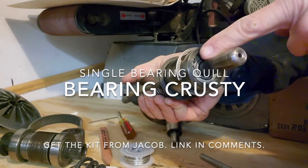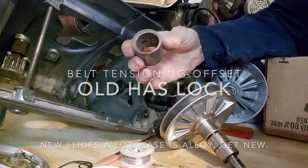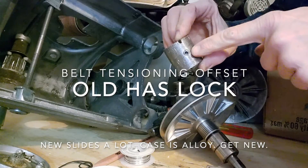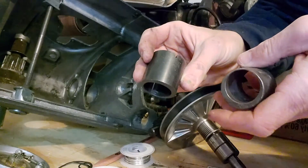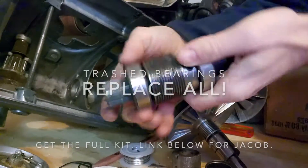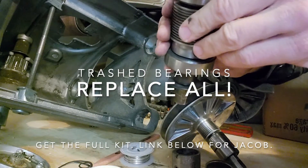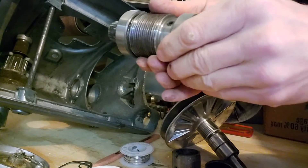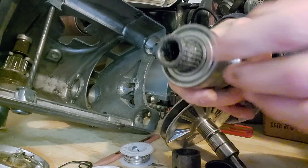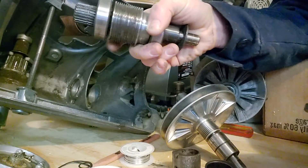Here in the quill it has a bearing retaining ring, so I could easily replace this bearing with a little press action. It feels kind of crunchy. I have the old piece that people thought maybe it just shook from having other parts that were bad — this has a locking piece in it and the more recent ones do not. This one barely turns. I may have put some skate speed lube in here to break them free a little bit. You can feel both bearings when you wobble back and forth — they have play, so these need to be replaced. Any time you have that play you're going to start wearing your machine parts by the thousands, and these teeth right here, if they get pulled up, they're now pulling up on another piece of the machine and that just creates hell where all these things sit and turn.